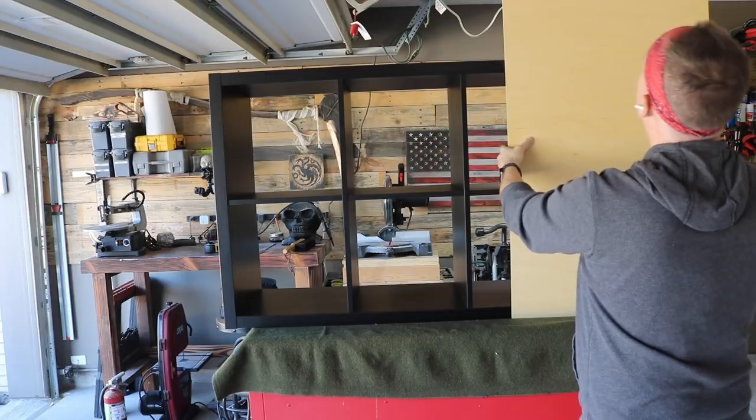Okay, real quick, while the lawn guys aren't making all the lawn noise next door, I'm gonna cut all 3 of these panels at the same time because they're all the same length, and I just clamped them all together, so it's just like cutting like a 3/4 inch piece of material. They need to be 29.5 inches.